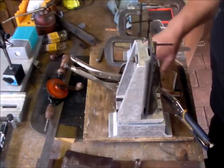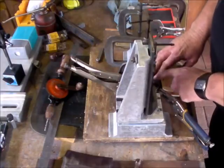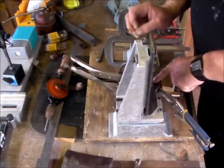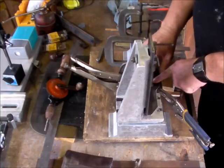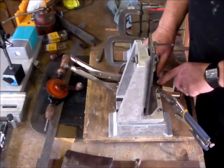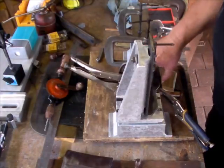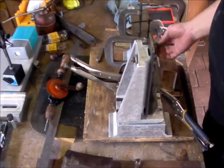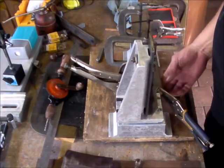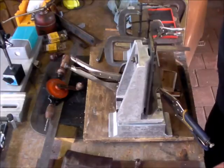It still was out approximately 12 thou. The only thing I can think of is when I drilled through on the second anchor bolt, the drill must have shifted slightly in the drill press. The dimple into the bed wasn't deep enough and I think the drill wandered off a little bit — by 12 thou. It doesn't matter for this one here, as long as the carriage clamps are clear of the bed ways throughout its travel. 12 thou won't be a problem.